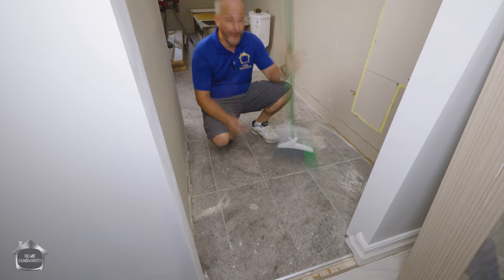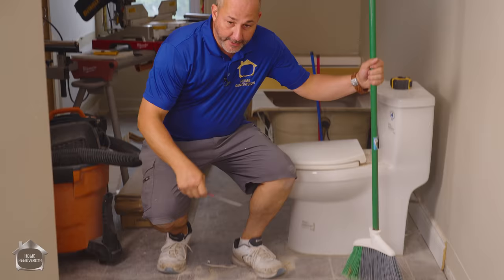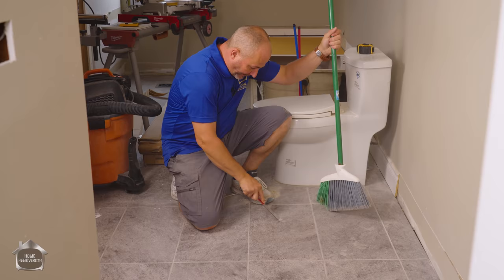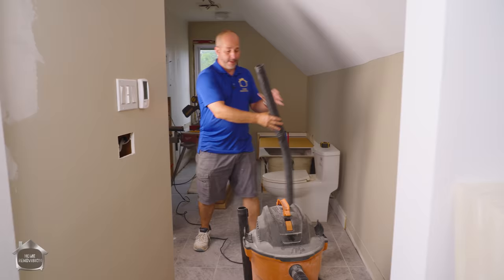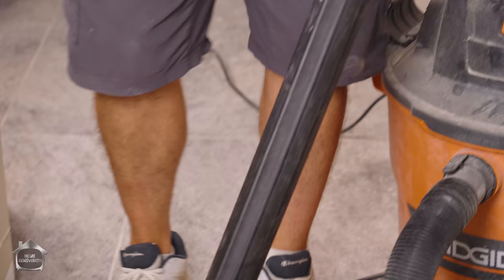Really go over the whole work area. I'm going to be installing flooring up to here and then I'm going to transition. Step three is vacuum. It's not good enough to sweep — dirt is your enemy whenever you're doing a flooring job. Get into all those nooks and crannies where you removed the baseboard and make sure all that debris is gone. You'd be surprised how much dirt moves around the room as you're dropping boards and moving around, so try to suck it all clean before you start laying your flooring.